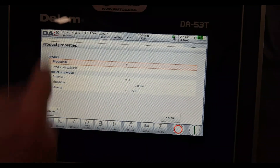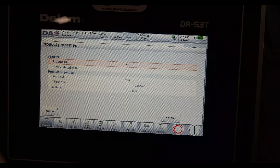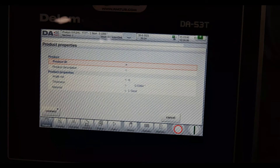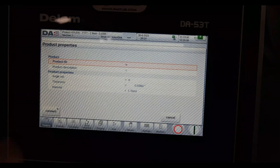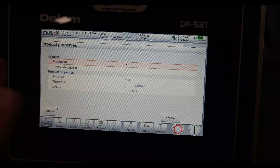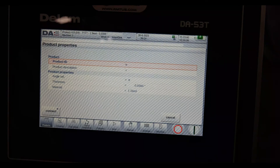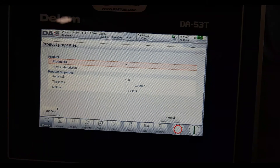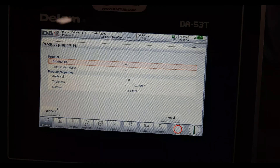If I was going to make a new NC program, I'd go through step by step — I can tell it angle or a Y position in NC mode. I prefer the graphical mode because I can see any collisions or if I need to turn the part. But for people used to NCX9-style NC programming, it's very easy to make a program. This control — I would think in a couple of hours, even if somebody's never been around a press brake, they'll have a pretty good basic understanding of what's going on.